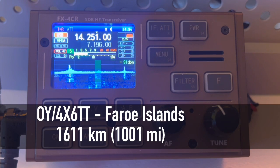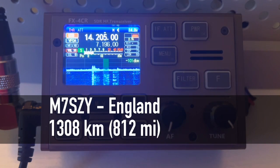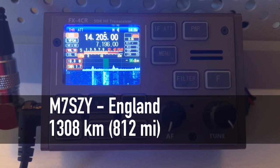Nice contact from the Faroe Islands there. Big hello from Liverpool to Poland — are you doing well today? You're sounding great! Is that a vertical or an inverted antenna? What antenna are you on today? Hey thanks — I just built this antenna. This is an inverted V dipole — a 20 meter dipole that I've done inverted. I just got it up, you're one of the first calls. It's so good to know I'm getting over there to the UK.